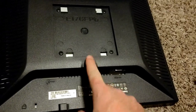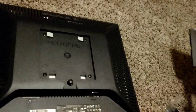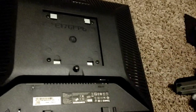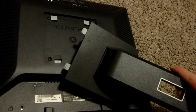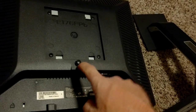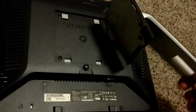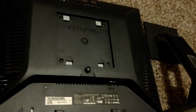Make sure you do not forget to put that button and spring in before putting everything back together and clipping it on. Because without that button it is almost impossible to get this thing out — I had to take a flat screwdriver and shove it down in that hole in order to get that latch to finally let go. Just a word of warning.